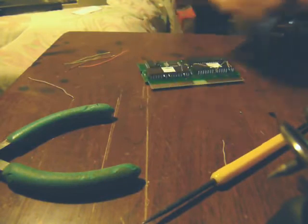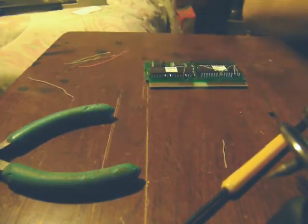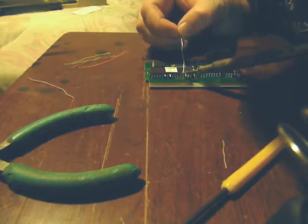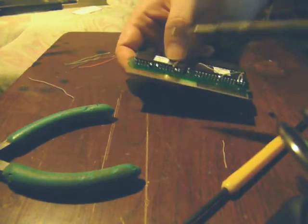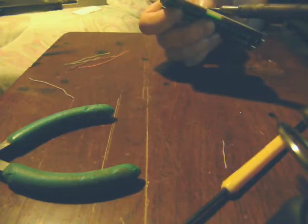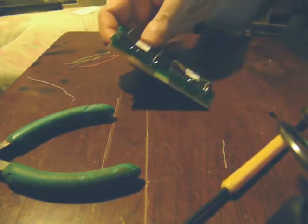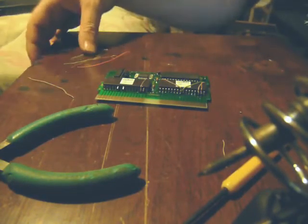Go from pin 1 to actual pin 30. Tin the wire. I actually went through this last time before I turned the camera back on. I went through and tinned all the pins, even though you won't use all the lifted pins. There we go. And now here's the part I really like, because it's just easy to remember. Love it.